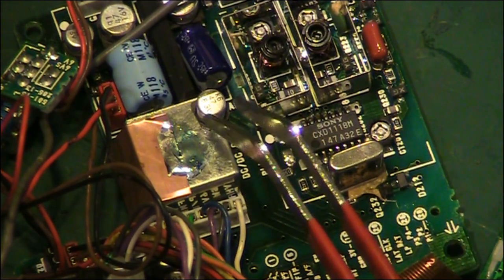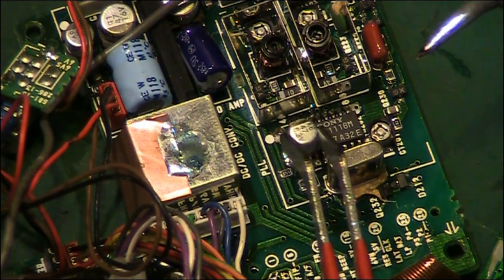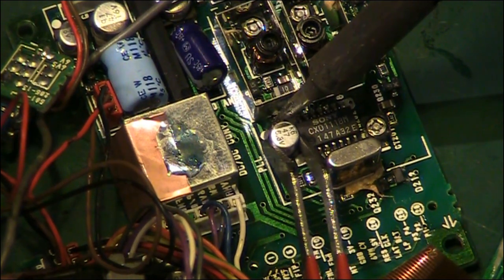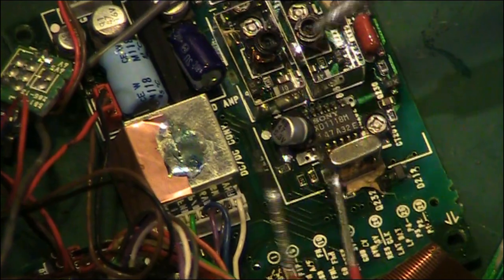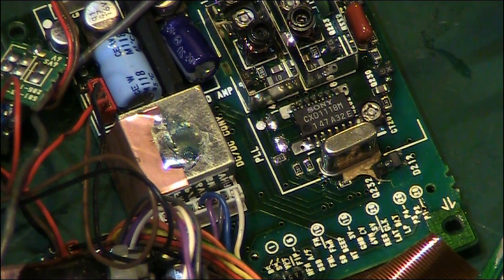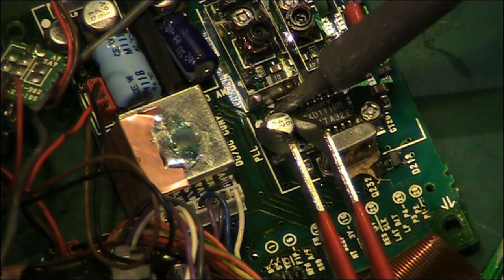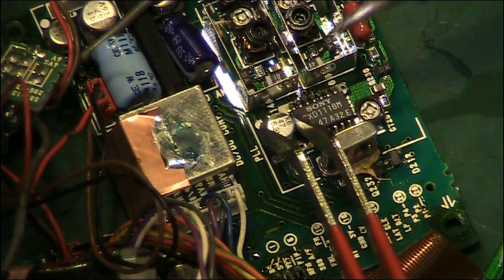We'll take the new capacitor. Get that in position. And we can just go down, solder that side. Oops, missed. Get hold of this capacitor again. That's better. So we will go in. That's that side soldered down. In fact, we'll just have to move it across a little bit because we can't quite get to that pad on that side yet.